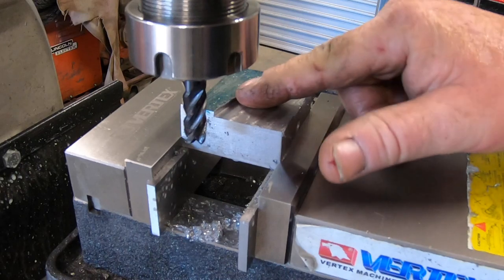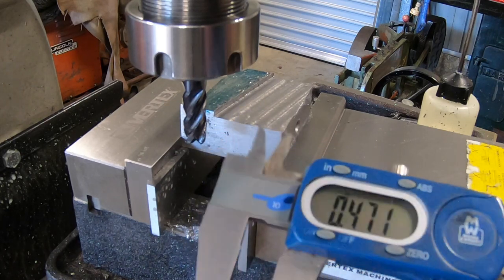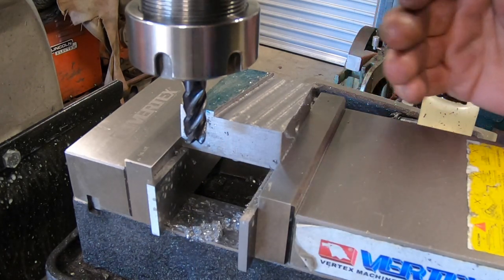I've got this side down 2.5 millimeters. I want to leave that 12 mil gap. So the gap in the bench grinder is exactly 12 mil. So I'm going to make this 11.95, just so it's got a little bit of play. 11.96. It may need a bit of a clean up with the file or whatever just to make it fit properly. So I converted that over to 471 thou,